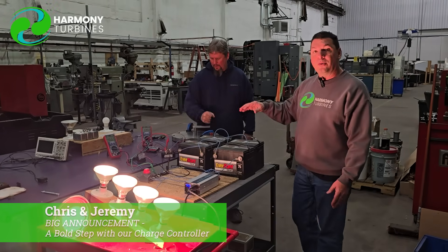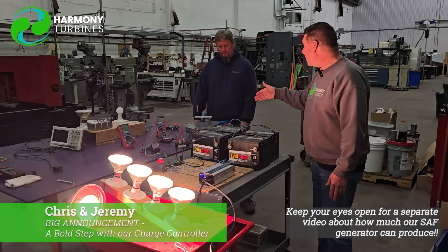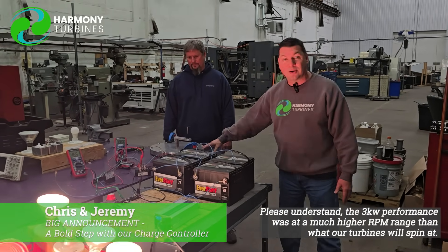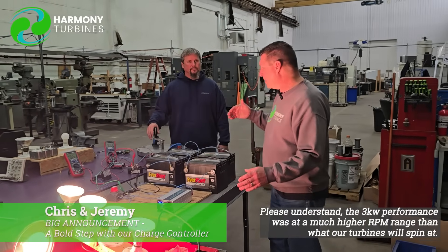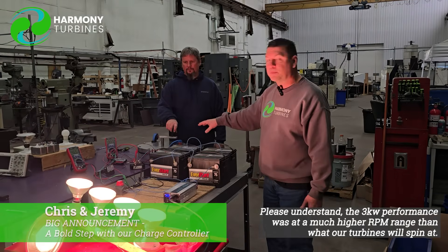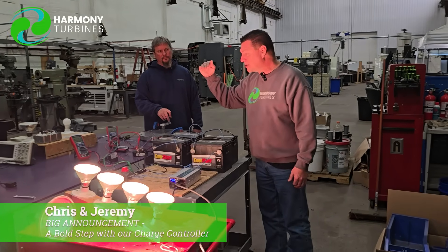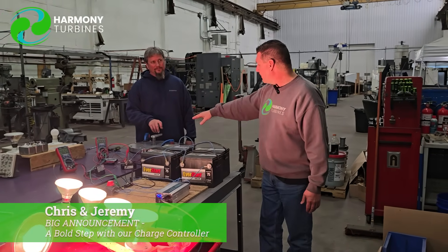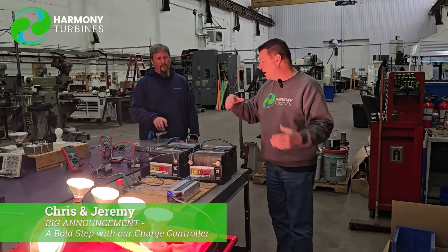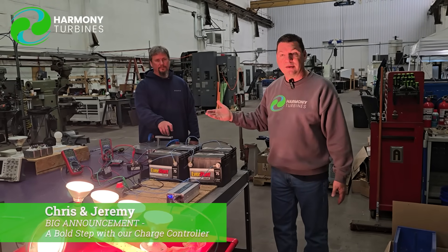We're going to do another video in a little bit and show you the upper end of what this generator can do. We got up to three kilowatts that we were making with our generator the other day — three kilowatts. Obviously out in the real world we're not expecting to get anywhere close to three kilowatts, but the generator can do three kilowatts and that's pretty insane. So we've got the generator locked down, we've got our charging system, we've got the upper-end battery protection, and all of it with soft start where we're not impacting the turbine with such resistance that it stops spinning. This is literally going to go up on the roof and spin effortlessly in the wind.